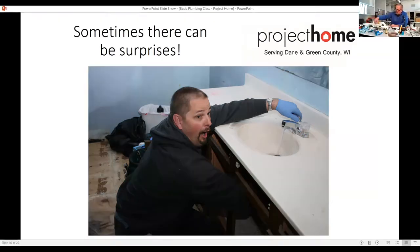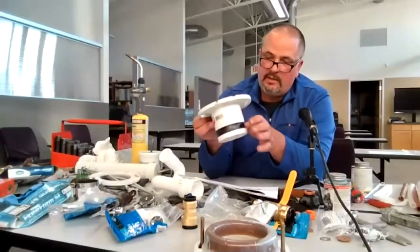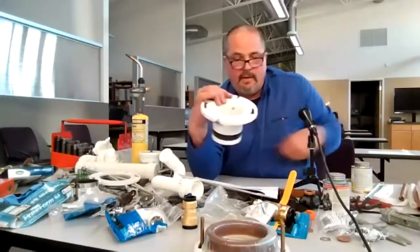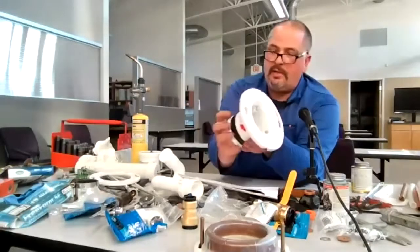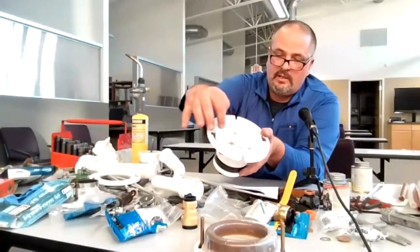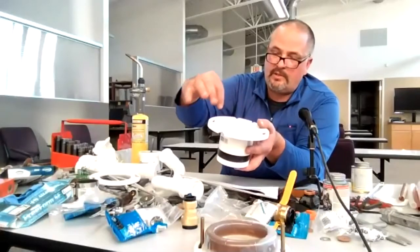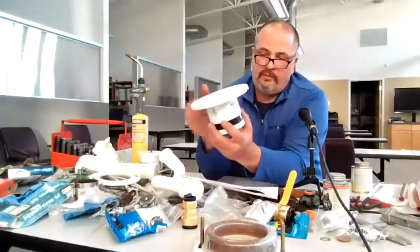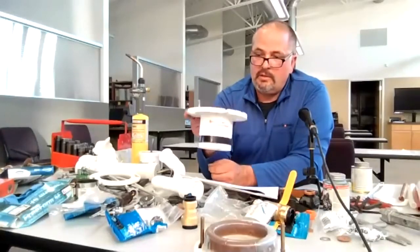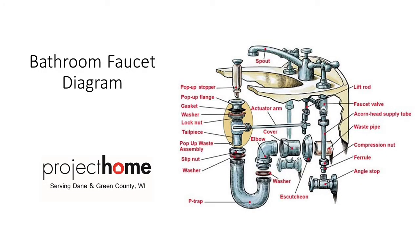This particular flange — you see this black around the bottom — it can actually go into cast iron. Taking these Allen wrenches, put the Allen wrench in and tighten these down, and the thing will expand out into the cast iron. Once all these are nice and tight, you can drill holes through the cast iron and put screws in to mount it. That's how I do a PVC replacement for a cast iron toilet flange if the flange is below the floor.